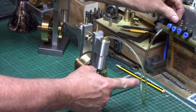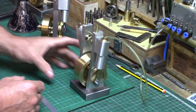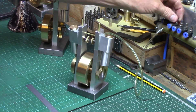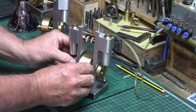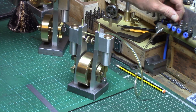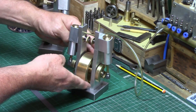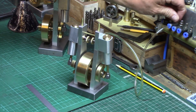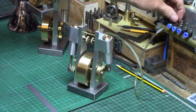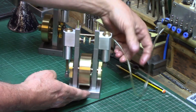You can see the oil coming up the tube. It's not always going to be self-starting — it depends on where it is. If it's at top dead center or bottom dead center it's going to struggle to start, but as long as you set it anywhere in between those points and give it a pulse of air, it'll start running. As you can see, it runs quite nicely.